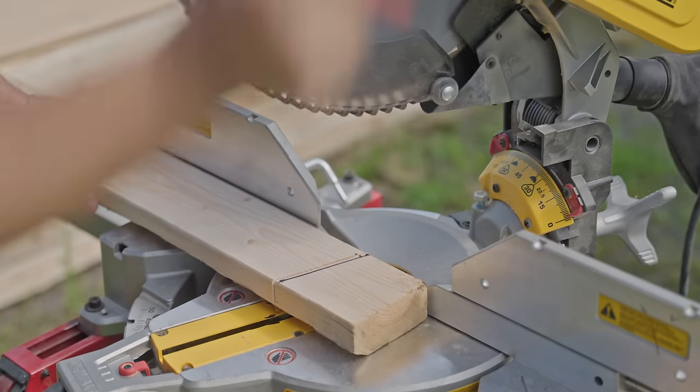All right, now, we're going to just leave the rafters floating for now, except for where we have the brackets. Consider the first fastener being the screw gun, because then you can confirm you have the location, you're happy about everything. Using the screw gun gives you a nice pull and it holds it in place while you're driving your nails, okay? That gives you flexibility too, because if you have made a mistake or something slipped while you're tying it together, you can just back it out and do it again. All right. So am I doing two nails too? Yes. Two nails.